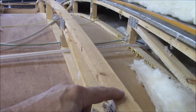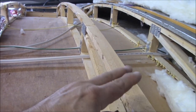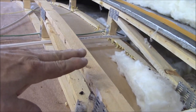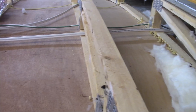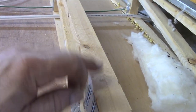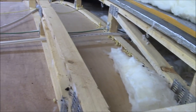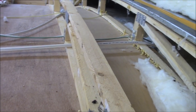That being said, when you put the glue down and use an adhesive, that will allow the coach to flex, but it'll stay bonded and it takes all the energy off of the fasteners, screws, staples, whatever it may be. So now the staples and the fasteners are doing their job holding it down, and the glue is preventing the unnecessary rack that it does not need. Depending on the glue you use, like this is just a foam adhesive, this is more of a stiff type glue, meaning it's hard. When it gets hard and doesn't have any flex to it, I wouldn't recommend that. We use a urethane adhesive, and that has a lot of flexibility to it. It will absorb more, but the coach is still going to want to rock a little bit and flex. We're just trying to curb some of that energy from tearing anything apart.